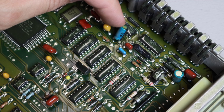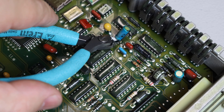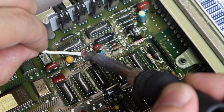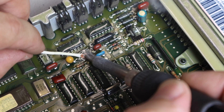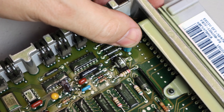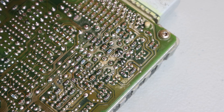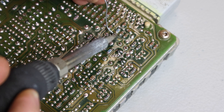There's the first one installed. To save some time I'm just going to cut the next one off. This one here is a 63 volt 10 µF, also rated at 105 degrees Celsius. The back has a rubberized waterproofing on it, so I'm going to have to burn through it a little bit. I use fresh solder to get to the old joints — once it sticks, then you can remove the old tabs.